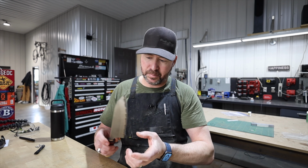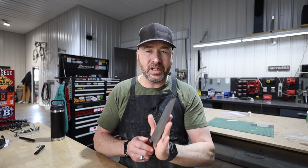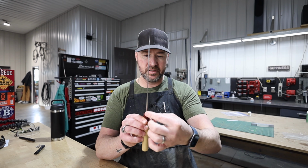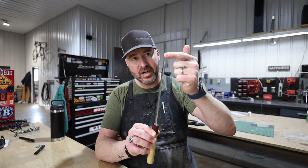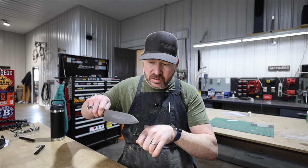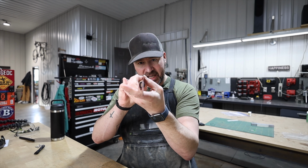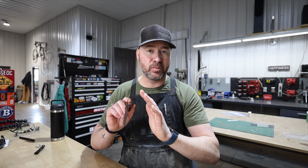And I actually went and took some calipers and started inspecting some of these Japanese knives we had. What I found was there's a few things that really affect performance of a kitchen knife. One, generally they start out with somewhat thinner material to begin with. Now this here starts out fairly thick right here at the handle, and it has a distal taper, meaning that the spine itself gets thinner as you get towards the tip, and that lends itself really well to fine slicing work. It still has some meat here if you're doing some robust chopping. And the other thing about it is that this has a hollow grind. They grind these on big stones, and what that allows is that right behind the cutting edge, it stays thin for a while. And that is the key to good kitchen knife performance.